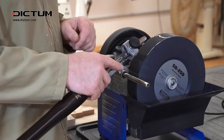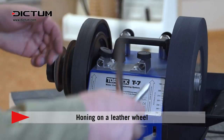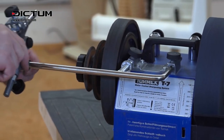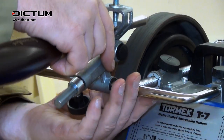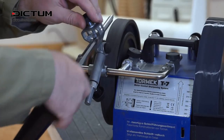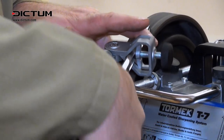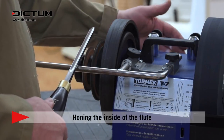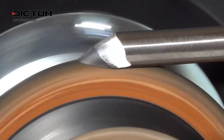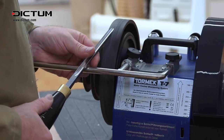The nice thing about the black stones is you don't have to press so hard. Having sharpened the tool, it's now necessary to hone the edge. I'm going to take the universal support arm, turn it around to the other side, and wind the wheel back a little so I've got room to move. Because this diameter of wheel is smaller than the stone, I'm going to put this in and just line up the bevel by eye and now I'm good to hone and polish that edge — plenty of pressure as you do so, and don't forget your honing paste. Then hone the inside of the flute carefully, bearing down on the honing wheel. It doesn't take too long to polish that inside edge — we now have a razor sharp tool ready to use.